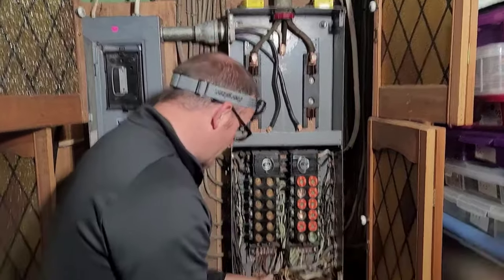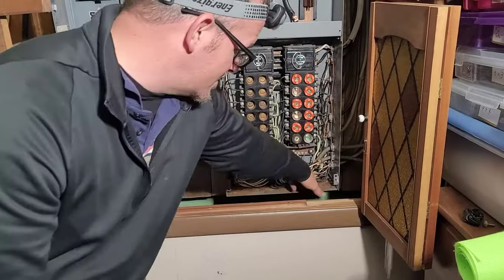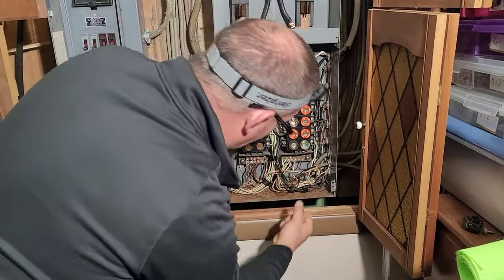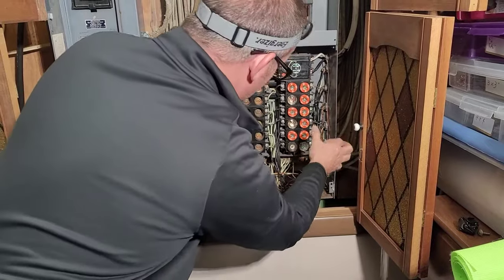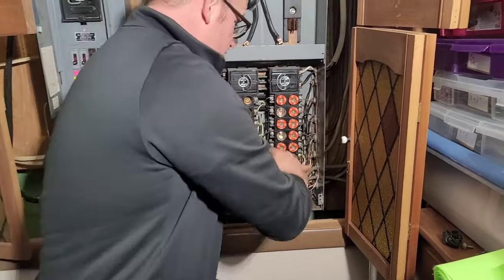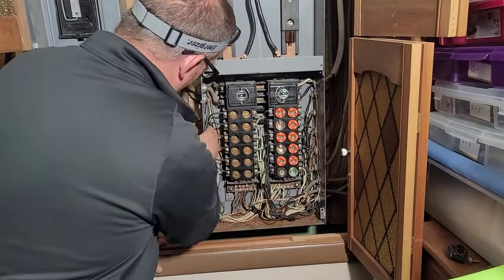So you're going to identify it and set it up. I literally go through the panel, verify that the power is disconnected to this building right now on the inside, and I'm going to physically start pulling out and grabbing them — oftentimes you'll find them taped together, or just laying there. You want to get those and identify those first, and make sure that you do not re-energize those circuits.